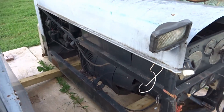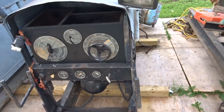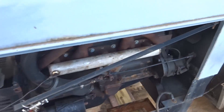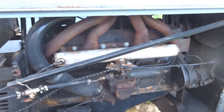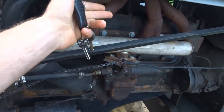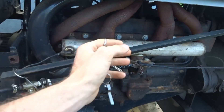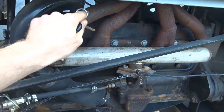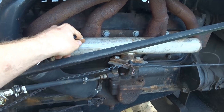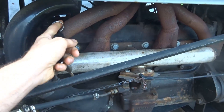This one is a 1946 Lincoln SA300 with a Hercules GXD engine. I actually made these headers — I didn't want to, but the original cast iron was all cracked, just a disaster. The exhaust runs through here and the fuel runs through here. Even though these two parts are welded together, when this thing's running, one side is ice cold and the other is scorching hot. I thought that was kind of cool.